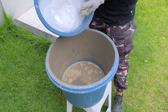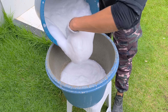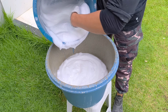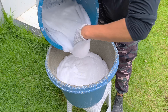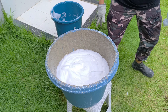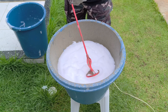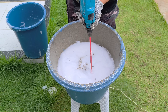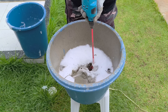Now is the time to incorporate the 30 liters of foam into the mixture. I repeat the same procedure as before using the mixer, but now with an important detail — the presence of the foam completely changes the behavior of the mixture. During mixing, you may notice that the consistency begins to change. Mix well until the foam is fully incorporated and disappears visually.